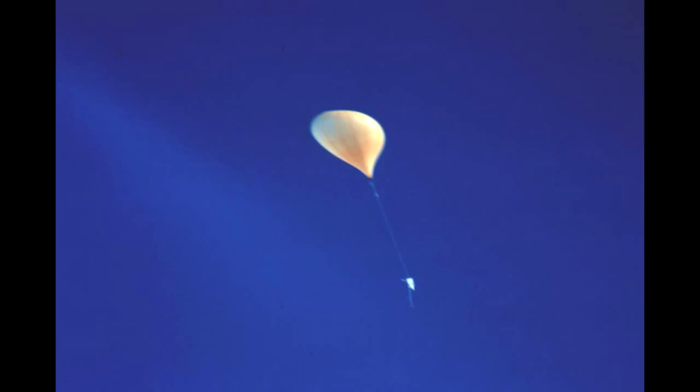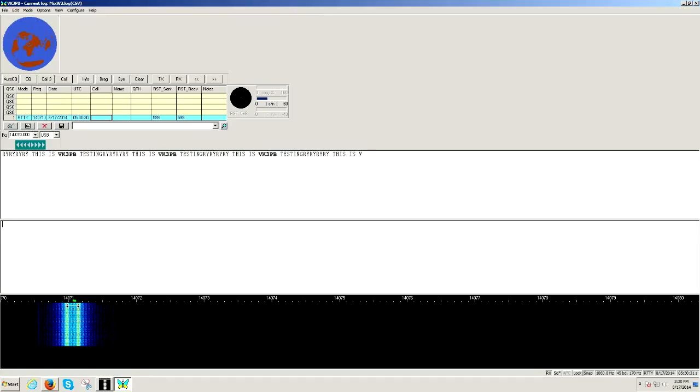So what remains to be done on this project? I simply need to install two simple transistors connected to two digital outputs on the Arduino and modify the software to turn the AD9850 and perhaps the GPS off when they're not being used. This will enable me to conserve power and allow 2 lithium AAA batteries to last much longer. I've already included a sleep library in the software, and I can put the Arduino to sleep for extended periods of time in order to conserve power further.